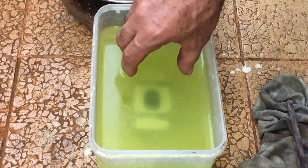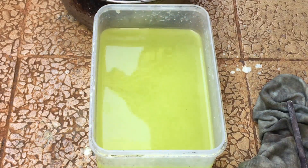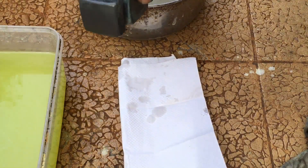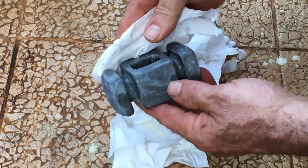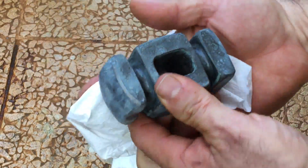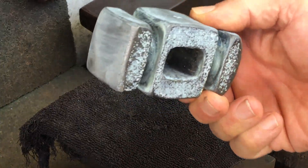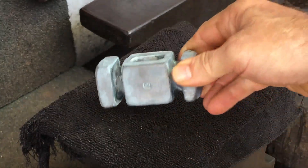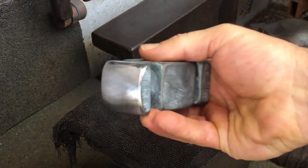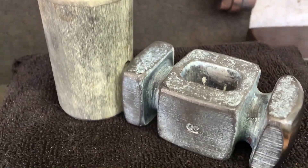After an hour, the oxalic dust settles on the piece. It may not be greenish yet, but you have to wait for it to dry for that to appear. Lo and behold, I've got something going on — but to be honest, it's more of an aquamarine blue. I would call this a coating, a sort of post-reaction of the oxalic acid after drying. I dress up the faces and overall it has a really pleasant appearance, but you can see how it's more blue than green when compared with the piece from the beginning of the video.